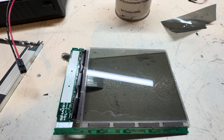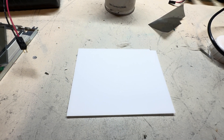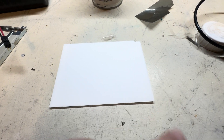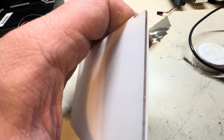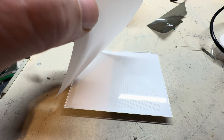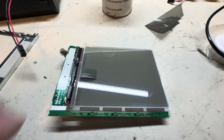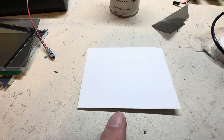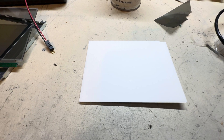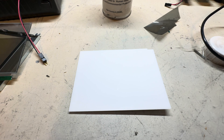I'll be able to order a new UV polarizer and the LCD should work once I get the backlight fixed too. In the next part of the video I'll have all the parts and reassemble it. When cleaning off the glue, you want to make sure you completely disassemble the LCD — that means removing the diffuser assembly as well. The fluorescent tube goes through this edge right here where it lights up, and the light spreads through this glass piece evenly. This is the diffuser. Make sure you remove it and don't get any OCA glue remover onto it, because if you do, you could damage it and the backlight won't be even — you'll see spots.